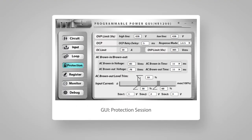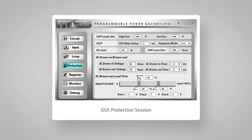While saving development efforts, HR-1200 also enables different final products with the same hardware bill of materials. For example, for Overcurrent Protection, or OCP, different end projects may demand different actions as the protection mechanism, such as hiccup or latch mode. With HR-1200, to change the OCP setting, you just need to program the products in different configurations without hardware changes, so there is potential to use the same design to serve multiple applications. There are many other features available to be configured, and the details are covered in the GUI user guide that comes with the evaluation kit.